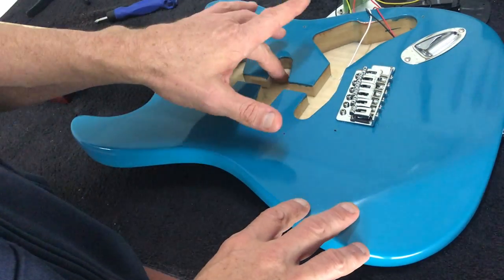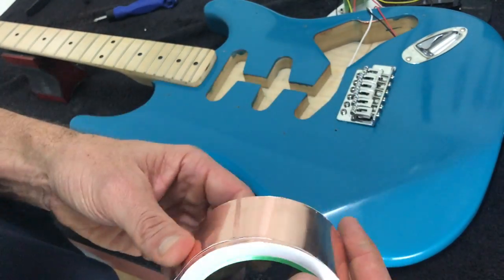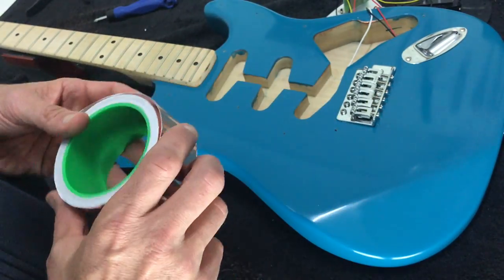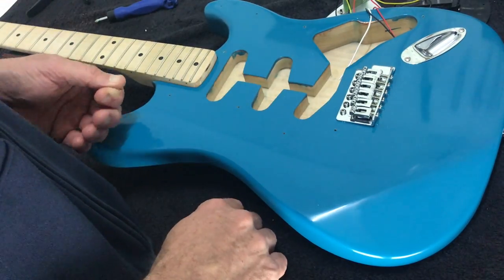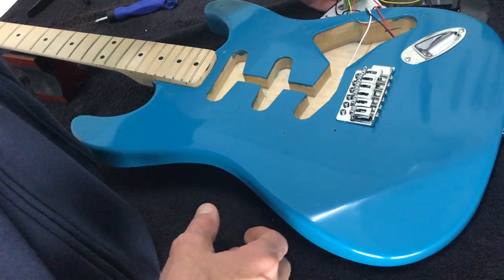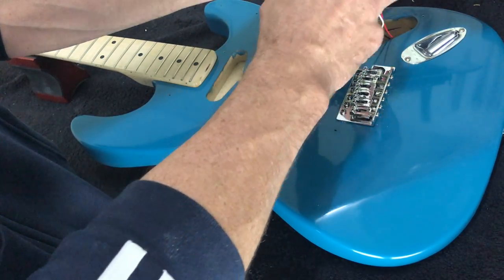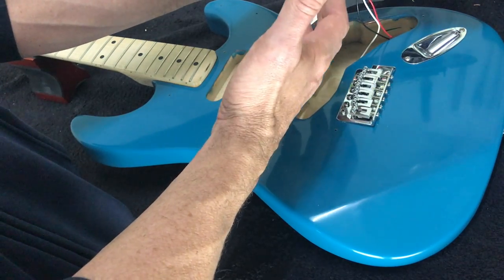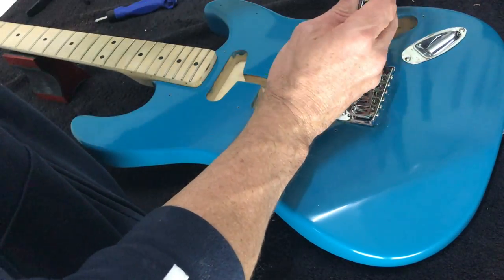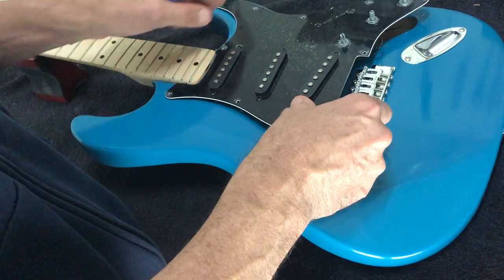As I explained, what we're trying to do here is shield the internal cavities of the guitar. I've got copper shielding tape here — you can get this fairly inexpensively on eBay. This is 50mm wide, and this size roll will do a few guitars. You can get something smaller if you're just doing one. What we're trying to do is line the internal cavities and also line the underside of the pickguard. You can see on the pickguard there's already a small amount of foil tape around the controls, which is predominantly there for that reason. But if we can cover the whole pickguard we'll be in much better shape. The first thing I'm going to do is remove some of these screws so I can remove the pots.